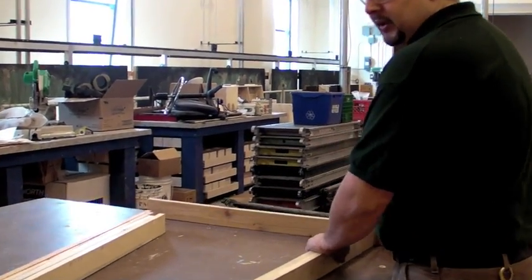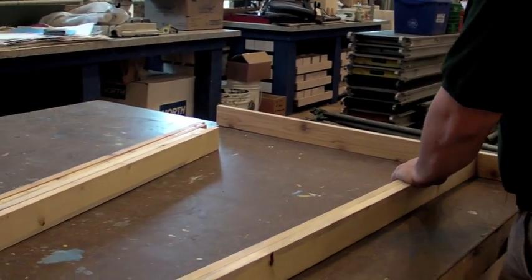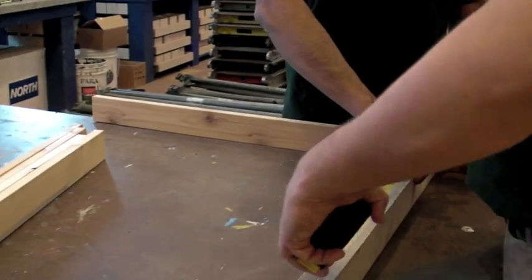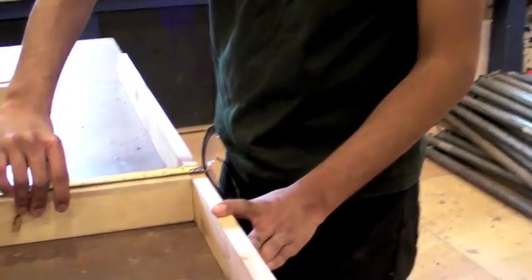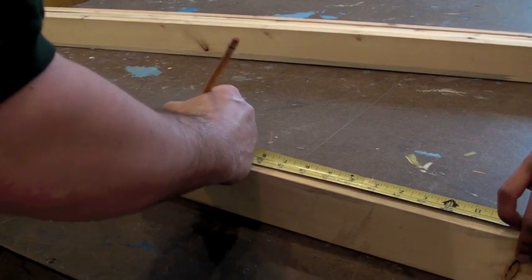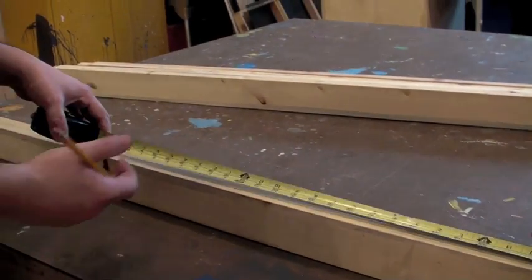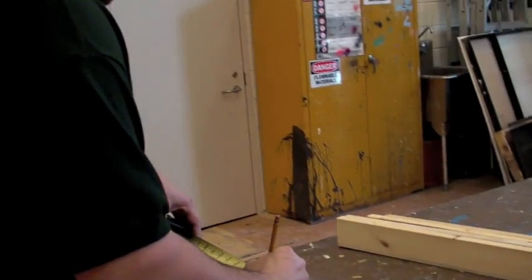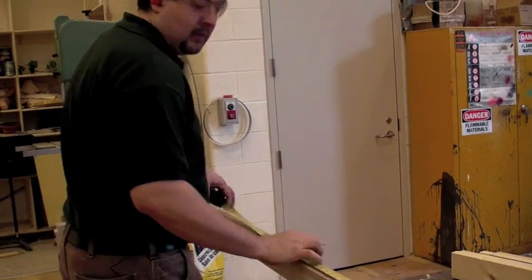Unlike the other flat I did, this flat is going to be built standard, and it's going to be built so that you have your toggles at two foot centers. I've put a rail at the top because you are going to be doing your measurements from the top of the flat, and since you're going to have a rail sitting at the top of your flat, you might as well start with one now doing your measurements. You could do a two foot measurement so it's two foot on center, or what I like to do is split center with a 3/8 of an inch mark on either side, so you end up with a 3/4 inch gap in the middle, so you know exactly where your wood is supposed to go. It's just an extra couple marks, and that way you know you're going to be perfect, or as close to as you can be.